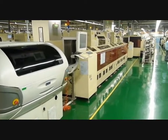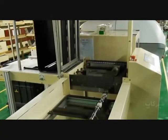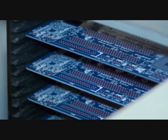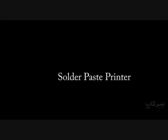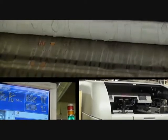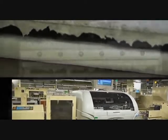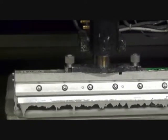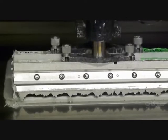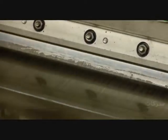For all the components that don't have pins going right through to the other side of the PCB, but have their electrical connections on the edges like the audio chip, or below them like the chipset, every part of the PCB that will be in electrical contact with a component gets a special soldering paste. The solder paste acts like a glue for all these chips before going into the reflow oven for definitive soldering, so every small component can stay in the right position. The solder paste is applied only where the components will be placed.